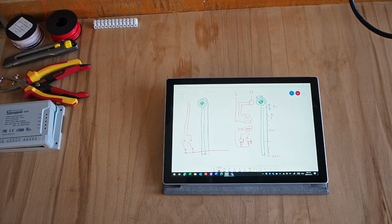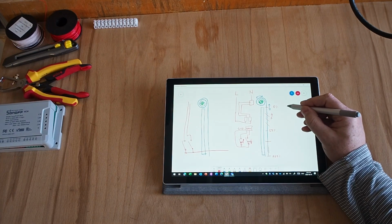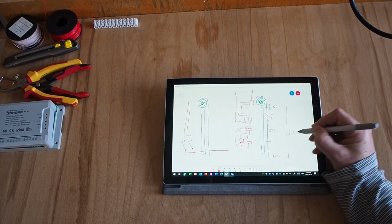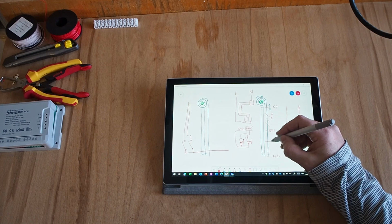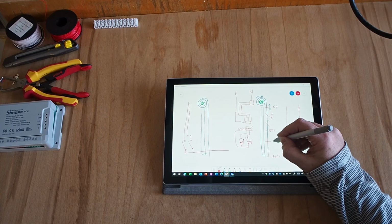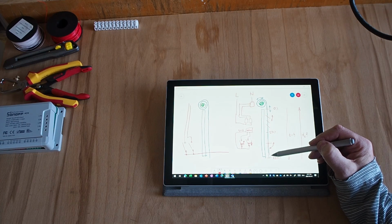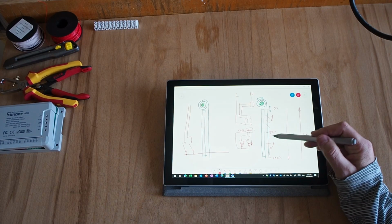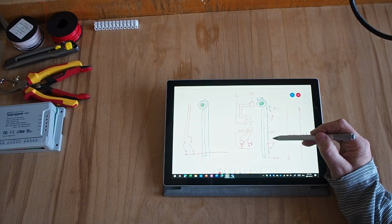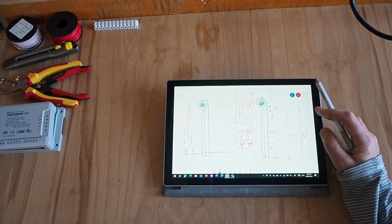Now the way I can do that is if I remember the current position of the cover, where it is, and if I know the time for the shutter to come down, or the time to come up indeed, if it's not the same. And if I also know the time that it takes to tilt the blade from one position to the other, then I can program the Arduino, so when I send to it the target position and tilt, it will close the relays for exactly the time needed for the shutter to arrive at the desired position, and then it will open the relay again.